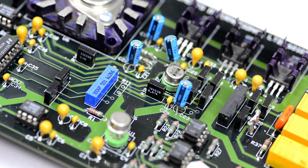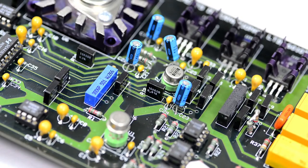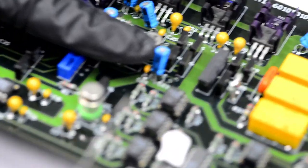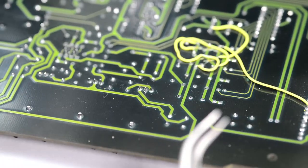So, it doesn't matter if we compare 10.1 milliamp to 1.01 milliamp, or if we compare 9.9 milliamp to 0.99 milliamp. The ratio is the same. So that's what is really important here, and that is how this bridge is able to obtain that extremely high performance. It's not relying on some magical super stable super low noise current source, but it's relying on the ratio between two current sources. And the ability to determine that ratio very, very precisely is what makes these bridges special.